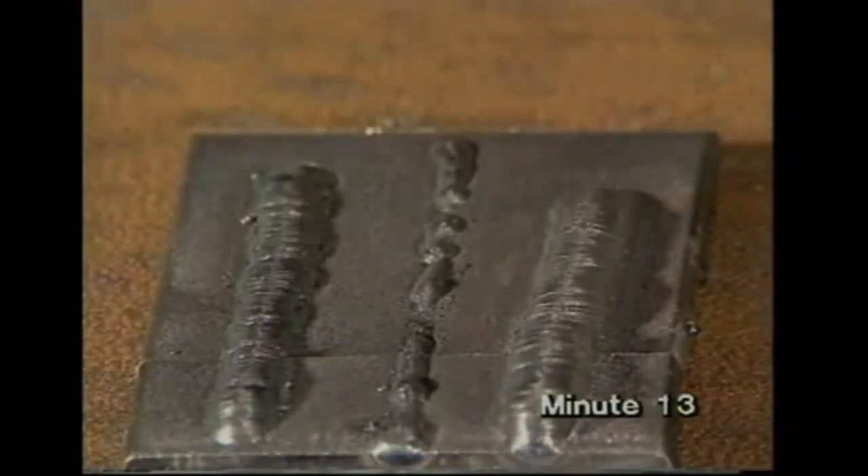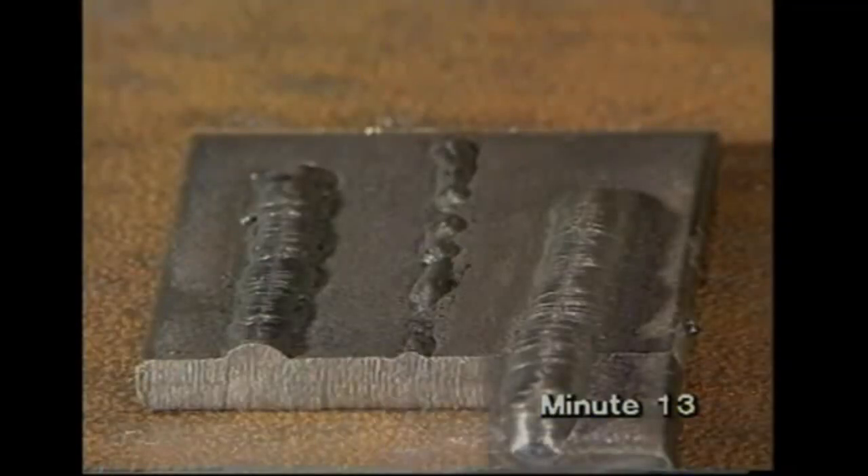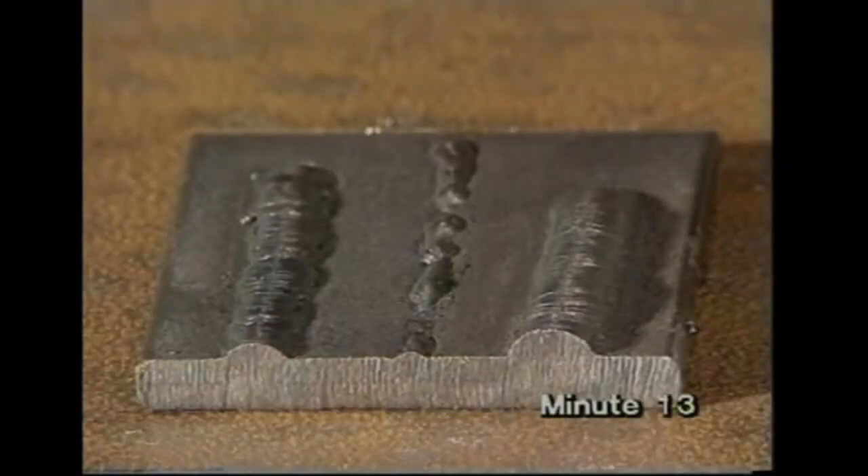Keeping the right travel speed is important. You may be going too fast. But if you go too slow, the weld metal piles up and may put the arc out. The beads clearly show the problems: normal speed; fast — small and stringy; slow — large and lumpy.